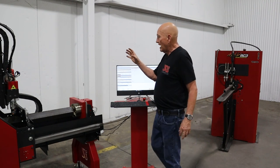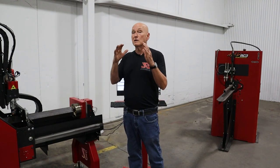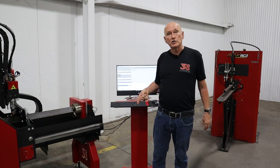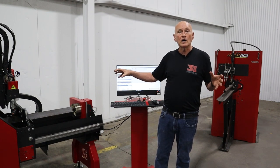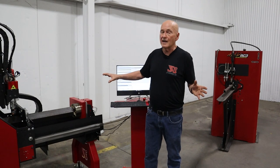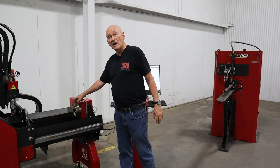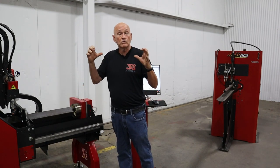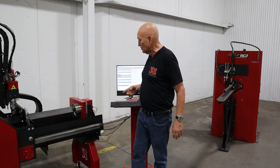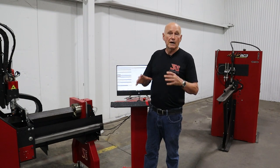The XR6 has a six-inch four-jaw synchronous chuck. The XR12 comes with a much larger ten-inch chuck. We don't want to use a huge chuck because chucks act like flywheels — the inertia of the chuck is subtracted from the inertia of the part you can cut, so you can cut a smaller part. We run a six-inch chuck which will easily handle anything up to six inches. You can see the tube coming in the back — that's for the cooling injection. I'm going to take you to the production area to show you the guts of the power head.